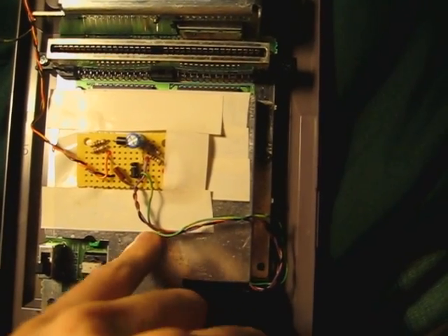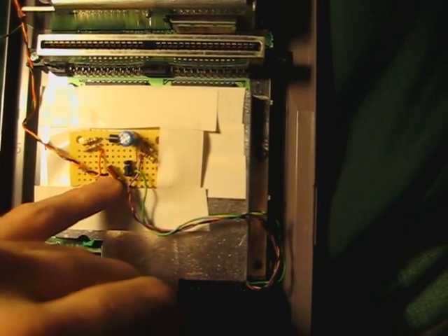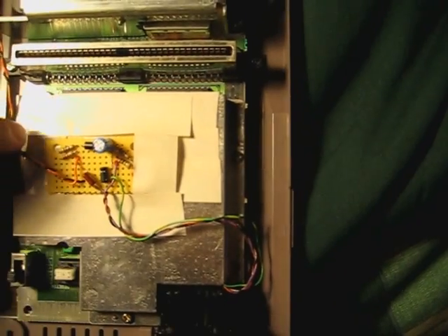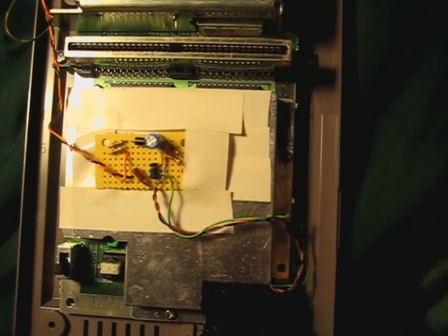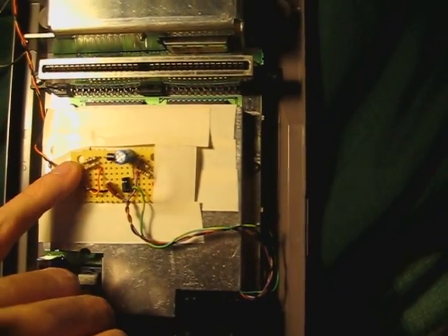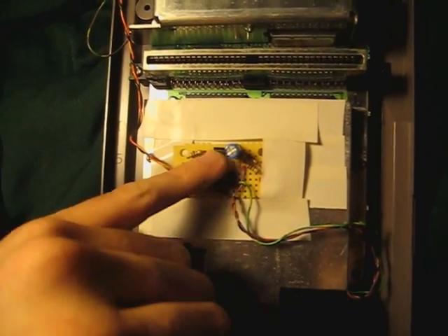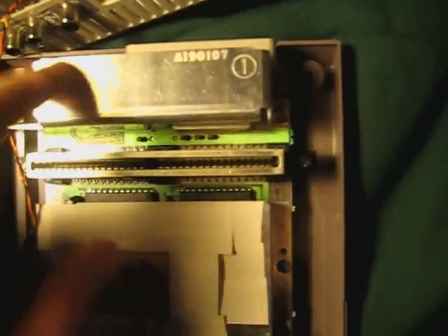So basically we're taking this filter as well as the amplifier — those used to be on the board. I had to add a smaller regular capacitor, an electrolytic capacitor, and resistors. There were some resistors on this side in the trail of the original video circuit that I obviously don't use because I disconnected the stuff right in front of them. The resistor values actually changed from the ones that were on the board, so I ended up using different ones. This filter came from back behind the shield — I had to take off the shield to get to it.